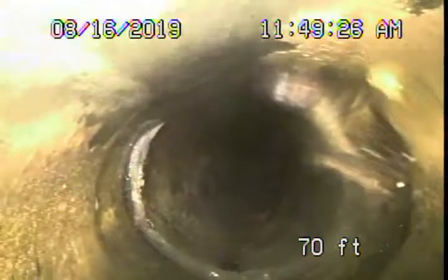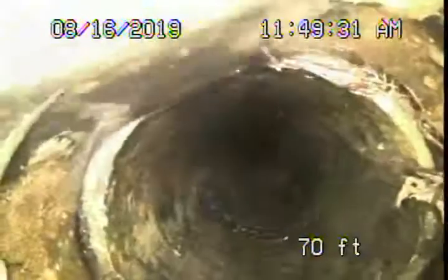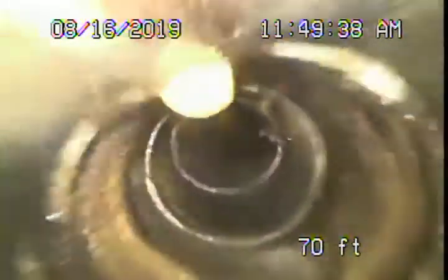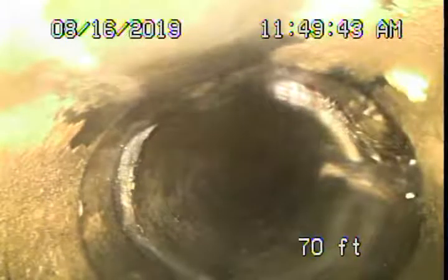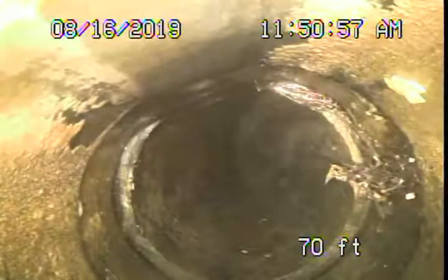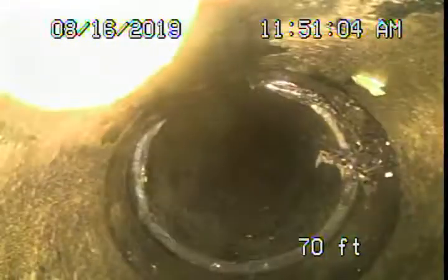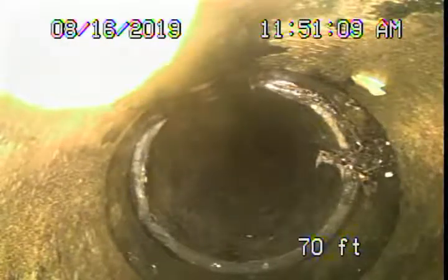What is that there? There's a bad connection over there. We should locate that. It looks like there are some roots coming through there. This we've located underneath the house, in the kitchen area. You can see that's a very poorly installed coupling because you've got roots coming into it — they probably used a cheap rubber band coupling. That's no good. That's underneath the house.